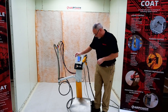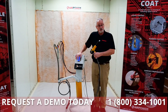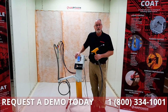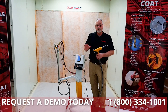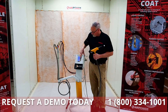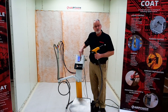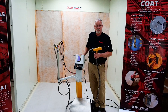We run with a couple of presets — that was on the old unit and it's also on the new unit, so it'll be very familiar to your people. Simple parts for flat. Recess part button for areas like Faraday cage and recesses down into deep draw parts. And recoat — that sets your voltages and microamps at the appropriate settings. When we're in these modes, we cannot get to 110 kV. We have control of powder outputs here or on the gun, total air from the controller only, rinse air, and fluidizing air — all done through those digital stepper motor valves for precise control.